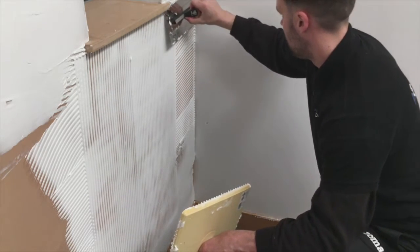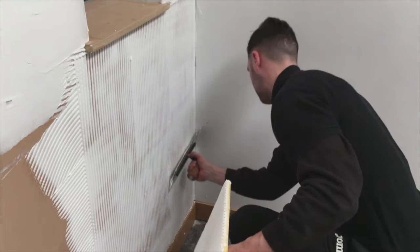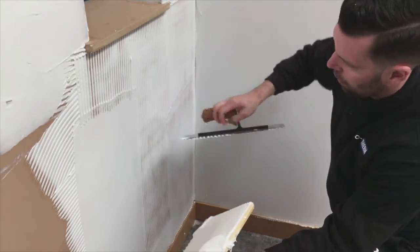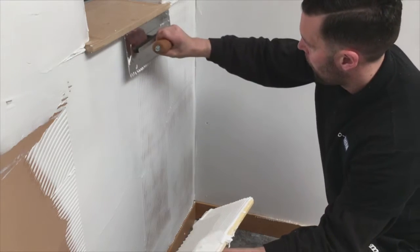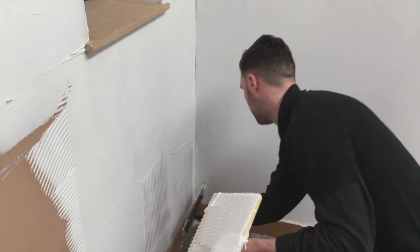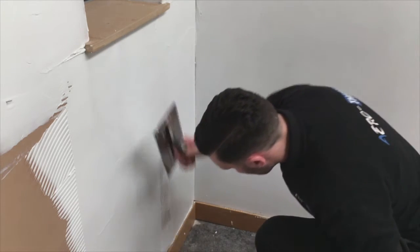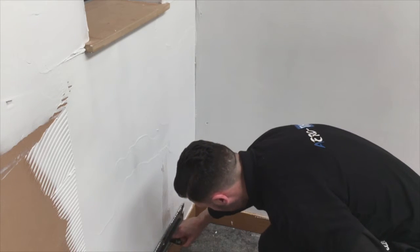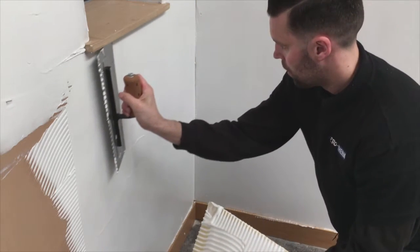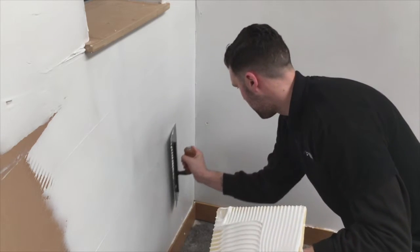For internal corners, make sure you butt up against the edge to ensure that you get a full coating. An angled trowel may take it out again. When floating over, the 2mm ridges will be pressed down into the gaps to create a consistent 1mm depth. Only float over the Aerotherm a few times, as it is not possible to float Aerotherm to a perfectly flat finish. As long as the wall has a consistent 1mm coverage, then be prepared to leave float lines and inconsistencies in the product and move onto the next section. The sanding and filling process will easily create a smooth surface. A clean, large, flexible floating trowel will, however, help to minimise any float marks.